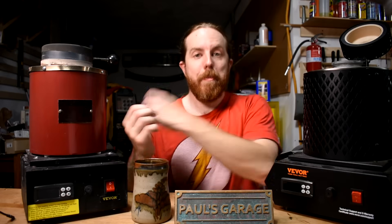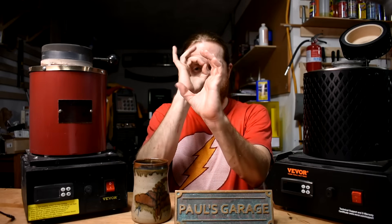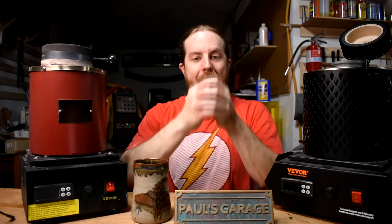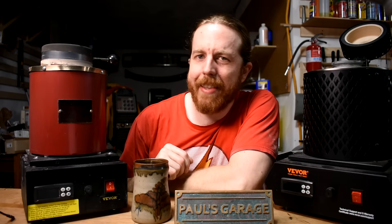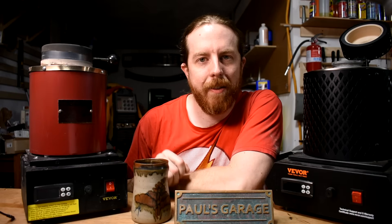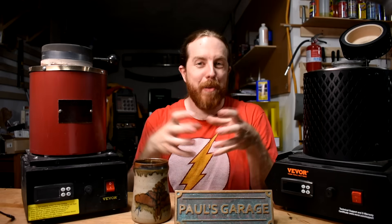Second: when metal is in there and heats up, metal expands. Metal will expand more than the crucible. If you had a cylinder that was a perfect fit to the inside of the crucible and you heated it up, before the metal melts it's going to expand and it can break the walls out. I put in chunks where I kind of had to wedge them in there, and I always thought that was risky. I've since heard it is possible to break crucibles from the inside like that. I was using grain, so it's probably not that — unless maybe it had sintered together and expanded as it was heating up.